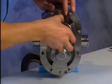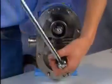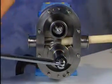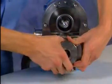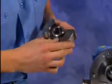Remove this horizontally oriented rotor. Remove the remaining rotor retaining nut with the wrench, again locking the rotor in place with the dowel. Remove the rotor. The rotors are sealed off, so they shouldn't hang up. But if they do, here are 3 handy ways to unstick them.